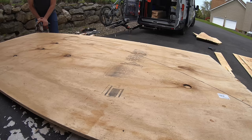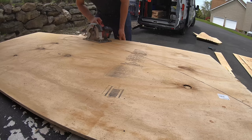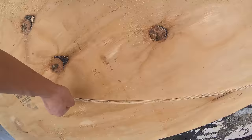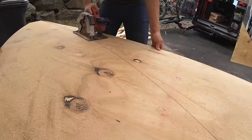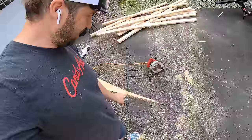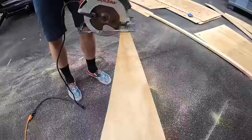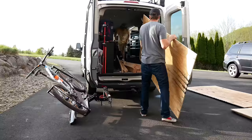We traced out the transition. The pro tip here is to use a circular saw, not a jigsaw, because the jigsaw is too accurate and it's too hard to follow the line — whereas a circular saw is more like trying to steer a barge. Using a circular saw will help you make that nice big curve a lot smoother. Also, the tips at the bottom are just going to break right off, so I usually take a two by four, figure out where it's going to sit on the bottom, and just hack off the rest.